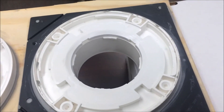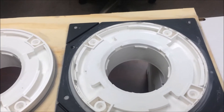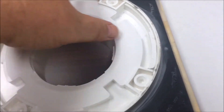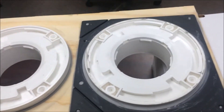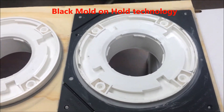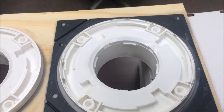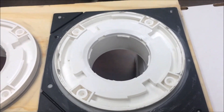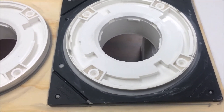The tile guide is made of recycled polypropylene, a quarter inch thick — you won't have issues with the toilet not covering it. We have dog ears that can be removed to accommodate some toilet footprints. This is meant to make tile installation very easy because only straight cuts are needed. With this totally secure system under your toilet, you have what we call black mold on hold — there's no way moisture can get into the subfloor either from the flange or around the flange. If you have a catastrophic leak where water is pooling on the floor, you can take the toilet off, clean the whole area knowing no water has gotten into your subfloor, and then reinstall the toilet. This is the first maintenance-type toilet flange that allows you to maintain the integrity of a no-mold environment in your bathroom.